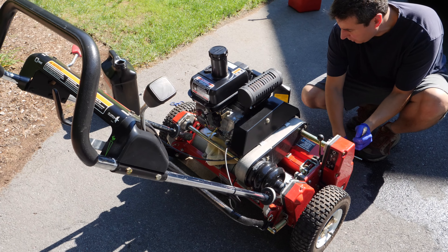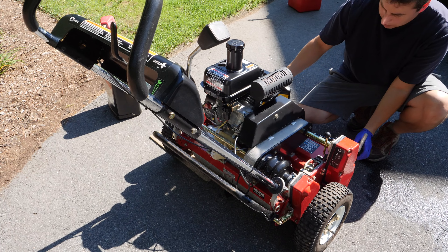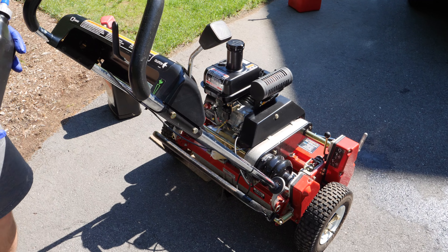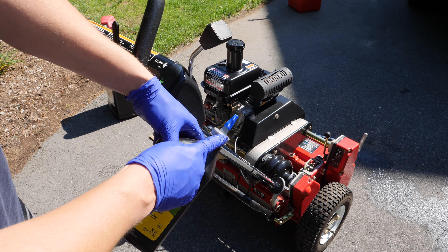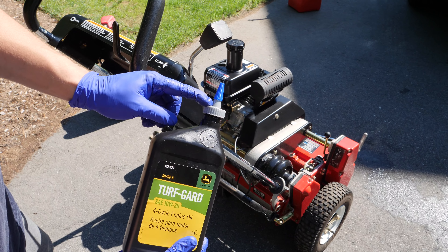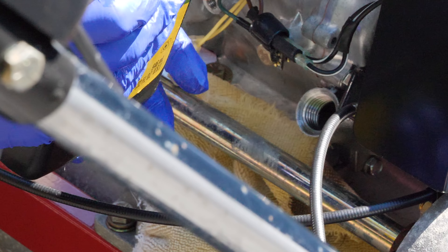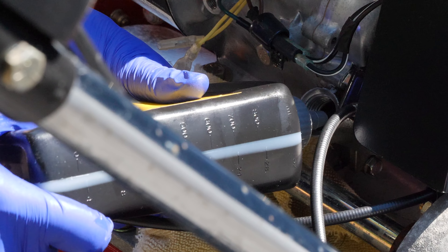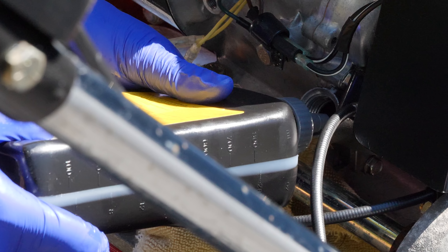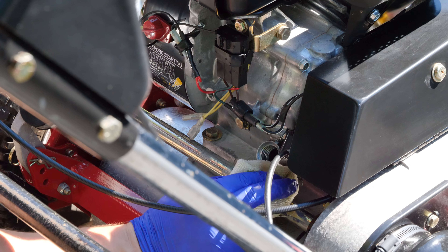Machines like this are a little bit unusual because they tend to work at an angle. Before you fill the machine up you really need to make sure that the engine itself is level — not the machine, the engine needs to be level. I cannot tell you how many people fill the amount of oil wrong and it really can damage the motor. I'm using some John Deere oil but all that really matters is the grade of the oil. I don't use funnels at all — I put these little caps on that you can get at your auto store, normally used to fill differentials, but they're basically like a built-in funnel and they work really great. I put my finger over it to hold the oil from spilling, put it inside the filler hole and squeeze it. All you need to do is fill slowly until the oil comes out, and at that point it's basically filled — you can double check it with your dipstick. Now we're all filled up, I'm just going to wipe up a little bit, replace the dipstick and double check the level.